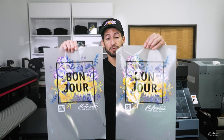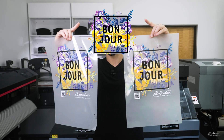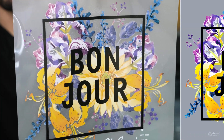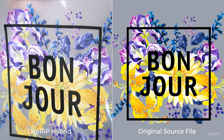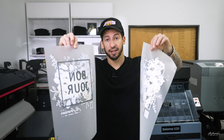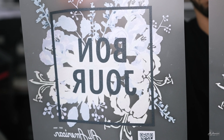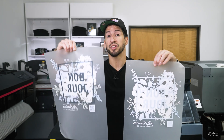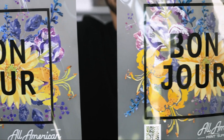Comparison time. Let's take a look at these two files — one printed with Garment Creator 2 and one with DigiRip Hybrid — and compare them to the original source file. On the Garment Creator 2 file, lighter colors like yellow and some darker imagery print a little bolder. But with DigiRip Hybrid, I see overall color accuracy matching higher to the original source file with better overall brightness. Interestingly, the DigiRip print used less white ink on the back while still delivering higher quality — meaning we saved ink, saved time, and got a better final product. This is because we used the optimized printing profile.